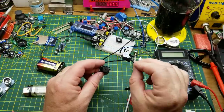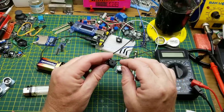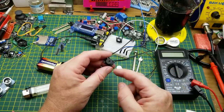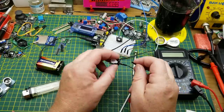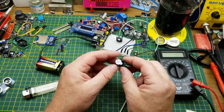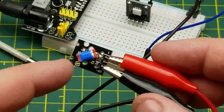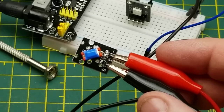There are two buzzers — one active buzzer and one passive buzzer. The passive buzzer is essentially a speaker: you have to put a waveform signal into it to make noise. The active buzzer just needs a voltage applied — it's quite loud. There's also a ball tilt switch with a little metal ball inside that rolls around and makes contact.